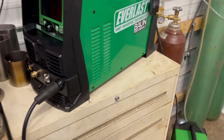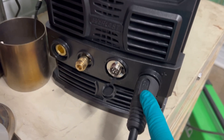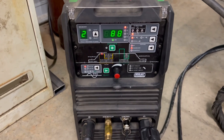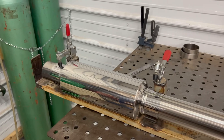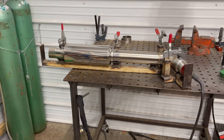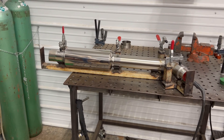One thing you may have noticed in that time lapse is I've switched the position of the leads on these welders — the positive terminal is on the right on the new Typhoon, while the negative lug is on the right on the older 210 EXT. I've got all the same settings dialed in, back gas flowing. This is a lap weld instead of a butt weld. One thing I'll say before I even get started: the Typhoon is incredibly smooth — the arc is more stable than I ever remembered the 210 EXT being. Let's try and get a good arc shot and see if you can see the difference I'm observing from behind the hood.